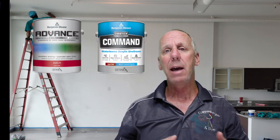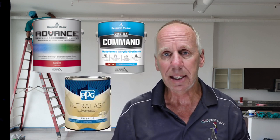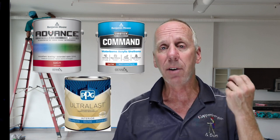So we need to make sure that we have something that prevents those oils from penetrating through the top coats of the cabinet grade paint. Any one of these 3 paints works very well and is very durable: Advance by Benjamin Moore, Command by Benjamin Moore, and Pittsburgh Ultralast. I have tested these for over a year. I put oils on top of cabinets and just do a little scratch test, and these have held up.